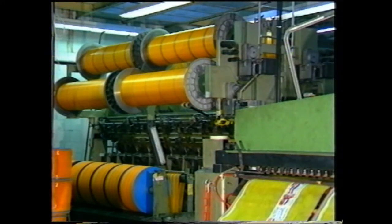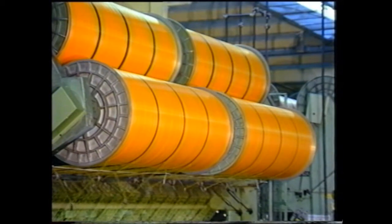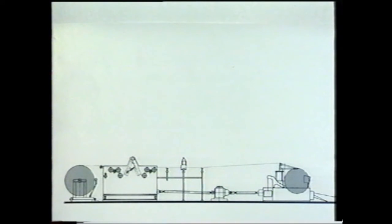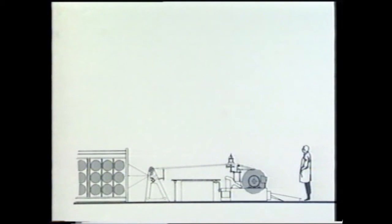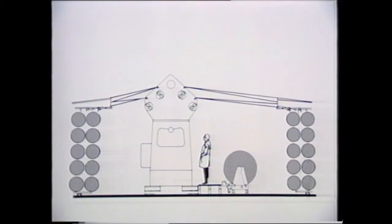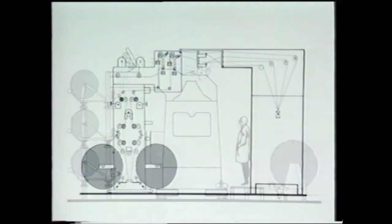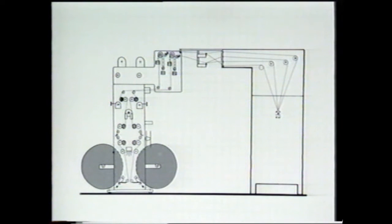The yarns are usually supplied in the warp knitting mill by warp beams. Beaming can be performed using the following methods: film slitting draw warper and beaming unit for feeding primary film, direct warping or direct beaming of fully oriented tape yarns from bobbins. Other possible methods are takeoff of fully oriented tape yarns from creel, film slitting unit for feeding fully oriented films, EZO system for feeding primary film.